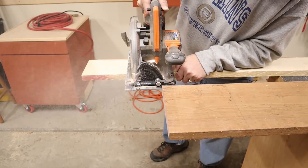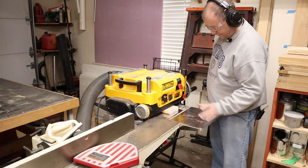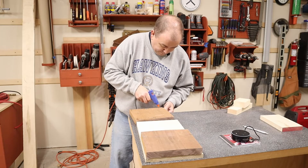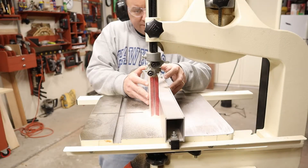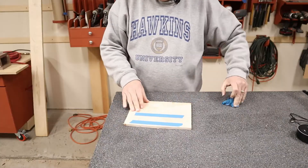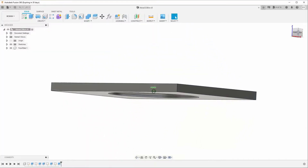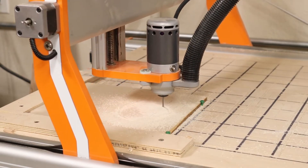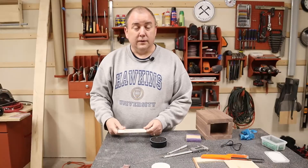I've become a big fan of using walnut in all my projects since using it for my subscriber count display and on air sign. I used walnut for the sides and bird's eye maple for the front. I start by rough cutting a piece of each and then milling the pieces flat and square on my joiner and planer. I re-saw the maple in half in order to glue up two pieces for the front, as my maple board was just about a half inch too narrow for this project. A key part of the aesthetics for this project is to make it look like a speaker box, and to achieve this look I wanted a clean, tight fit between the Echo Dot and the faceplate. I used my CNC to cut the circle on the faceplate that holds the Echo Dot in place. Okay, here's the moment of truth.